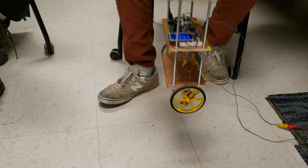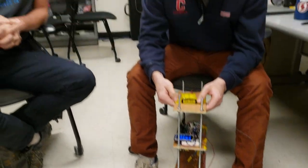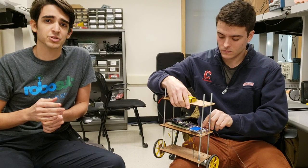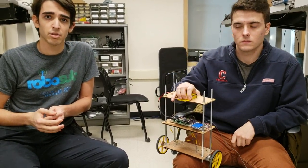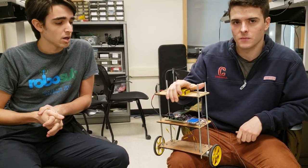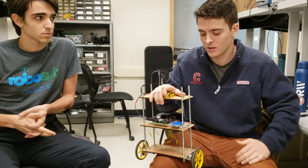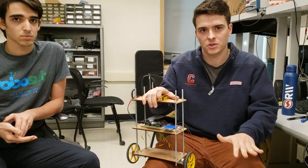What algorithm are you using? You have an accelerometer that you're reading. Right, so we have an MPU-6050 as an accelerometer and a gyroscope that we use to take angle measurements. We tried several different filters on those measurements until we settled on one that mostly relies on the gyroscope, because the readings are so quick and the gyroscope readings are just much more consistent. The gyroscope works really well in the short term, so we high-pass filter it, and then we low-pass filter the accelerometer so that the angle doesn't drift too much in the long run.